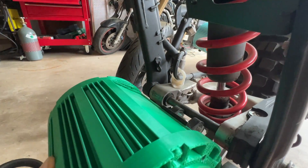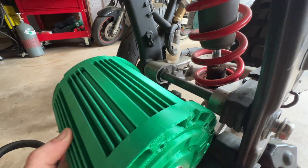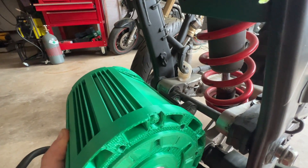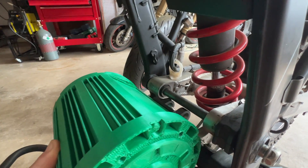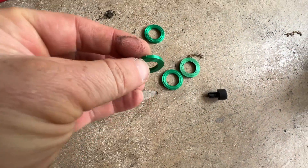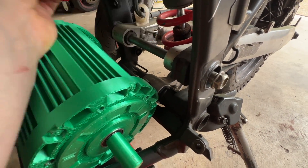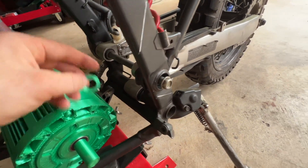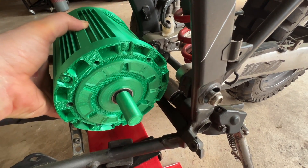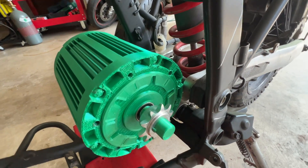That will attach like this — I bored those out to the size of this shaft, quite closely, although it could be a little bit tighter. I need to figure out how far along this axis the motor will attach. What I did was print a bunch of 3D printed spacers that go on here, and I can incrementally put as many spacers as I need on either side, giving me a known distance. I'll just add and remove spacers until it looks how I need. Here's the motor attached to the shaft.